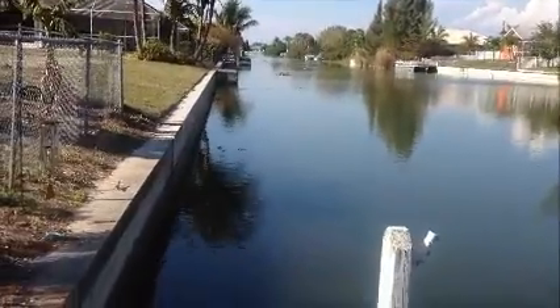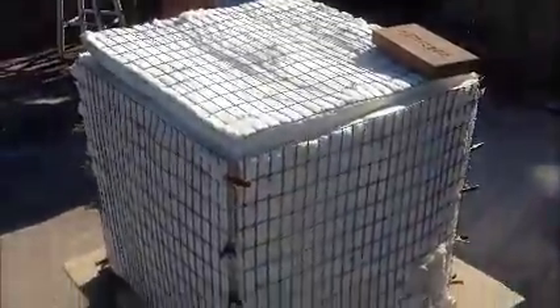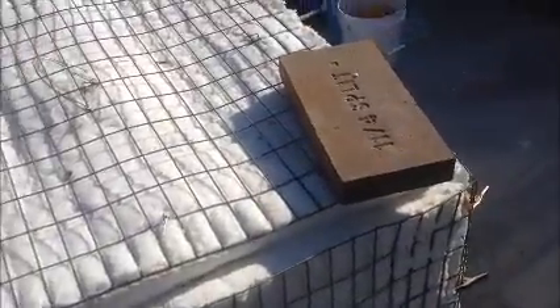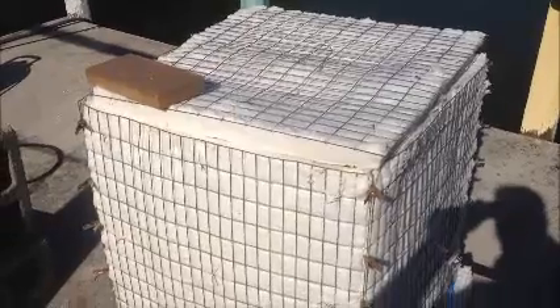It's about 10 minutes after 5 o'clock. I shut the kiln off about an hour and 10 minutes ago. I've got to haul all this stuff back inside. I've got one corner of the kiln that wanted to leave a little gap, weighted down, and I put a fiber plug in there where the burner port is. Everything's sealed up pretty tight. We got up to a high of 1755. We're at 1146 degrees now, letting it cool off by itself. Everything is looking good. Hopefully around 8 or 9 o'clock tonight I can unload this thing.